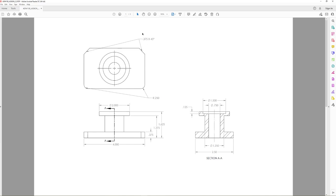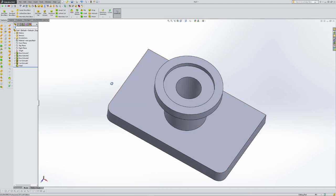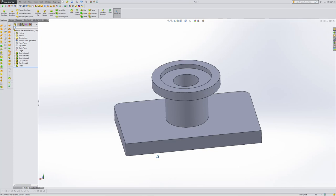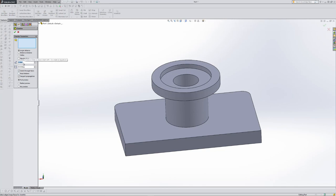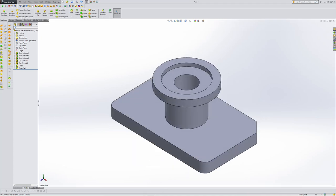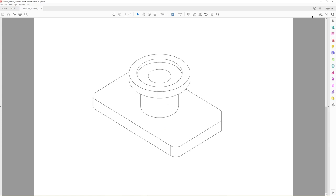Now we go back and put the 3/8-inch chamfers on. I do a Control+7, rotate around to see the back edge, drop the chevron down, and pick Chamfer. The distance value is 0.375 and it's 45 degrees. I pick this edge and this edge — it gives us the preview. If the preview doesn't show, make sure Full Preview is selected in the feature manager design tree. Happy with it, I accept. Control+7 to isometric — it looks great. Make sure you save your part with the prescribed name.